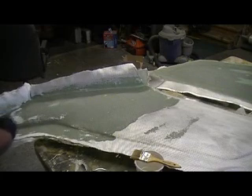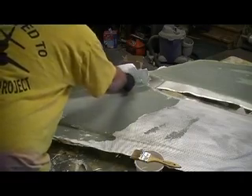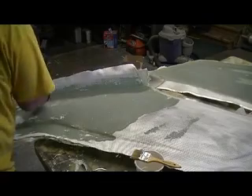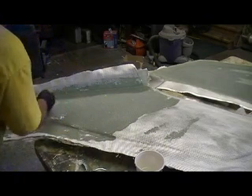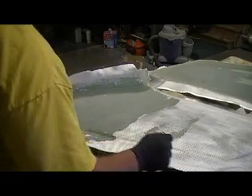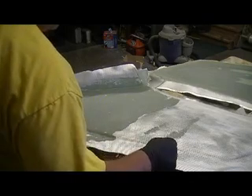Now granted, I probably have to go back and put some resin here and there. But it's just a way to help keep the air bubbles out of your mold. I'd still go with a heavy surface coat. The way I did it is the most time-consuming way, but it's probably the best way — it just takes so long. Them are some long layups, and you just can't stop every four hours. You've got to be there.